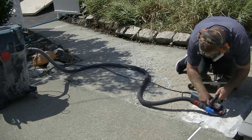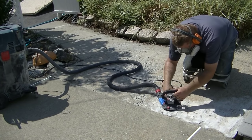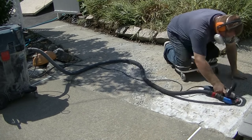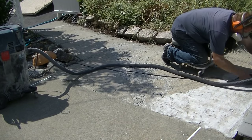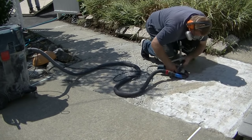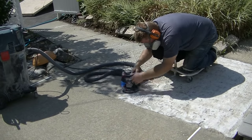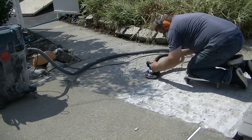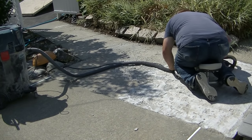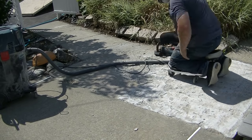The first thing we're gonna do is remove all the bad concrete on the surface, and one of the ways we do that is by lightly grinding it. I've got my little Bosch four-inch grinder with a diamond disc hooked up to my HEPA vacuum so we don't worry too much about the dust. Luke is going over the surface removing any loose concrete, and when he gets into the worst spalled areas that thing will really get it down to solid concrete we can repair.